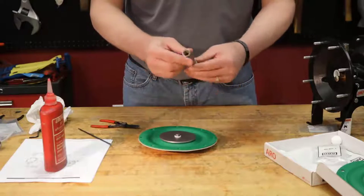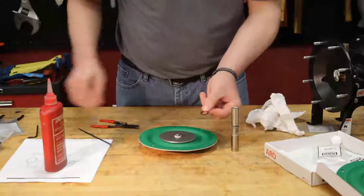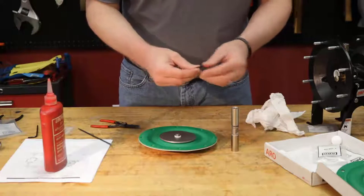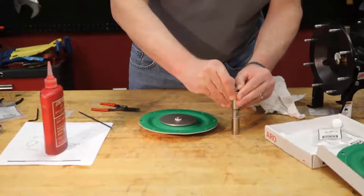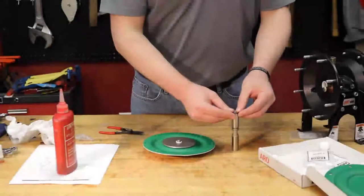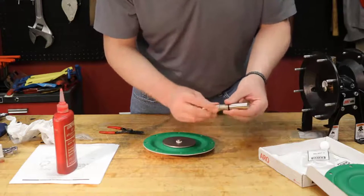Before we move forward, you can see here we have a seal to replace. Seal here out of your fluid section rebuild kit. You can see that it's a nitrile seal due to it being on the air side of the pump and not the fluid. Now this seal can be kind of tricky to come on, so we're going to try to pry that on there. Once you get your O-ring on the diaphragm rod, go ahead and slide it down. There you go, and it fits right in the track there.